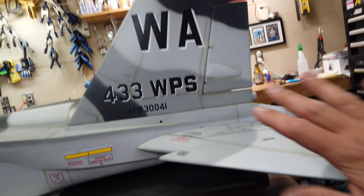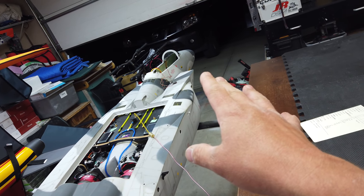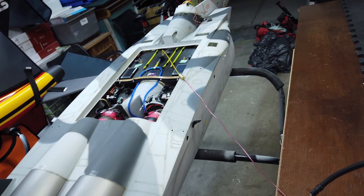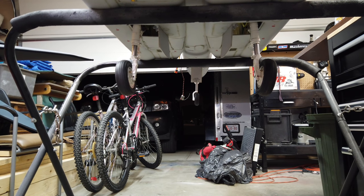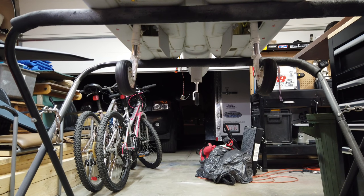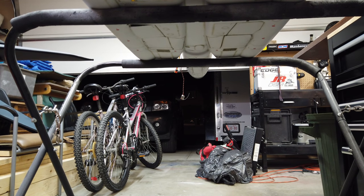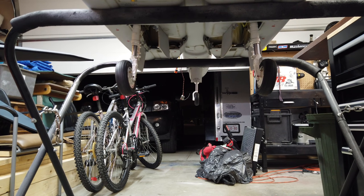The front air system is all hooked up with the gear. We're ready to test — hooked up the pump, filling the main air system to 100 PSI. We put a JR receiver in temporarily and everything works. Gear goes down, doors close.